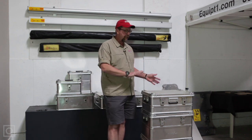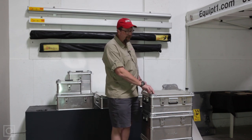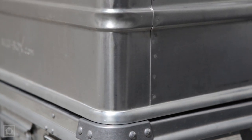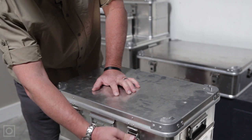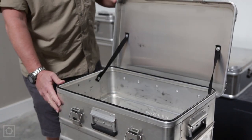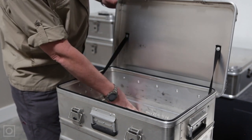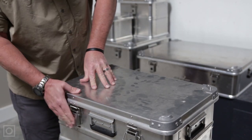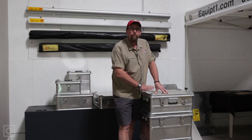Let's talk a little bit about the features of the cases. First of all, they are full aluminum cases. They come with cast aluminum corners, and what those corners are designed to do is to allow us to stack cases of a similar footprint together. The cases have spring-loaded latches on the sides and cam lever latches on the front end. There's a silicone bead seal around the entire lip of the top, and all seams are silicone sealed. The cam lever is a very tight lever that when you push it down in place, it compresses the silicone seal, making it a very weather-tight and dust-tight case.